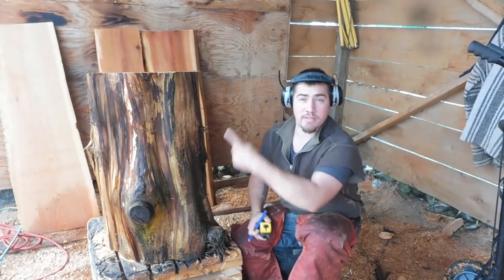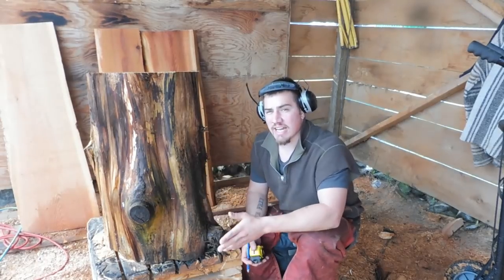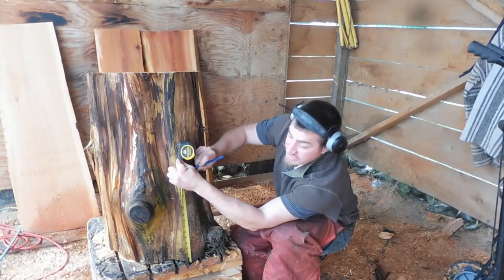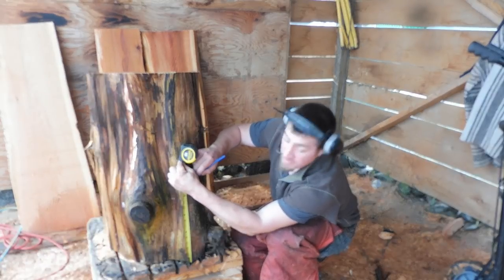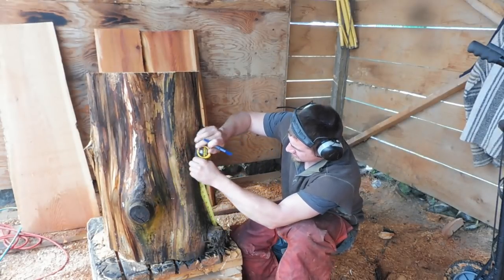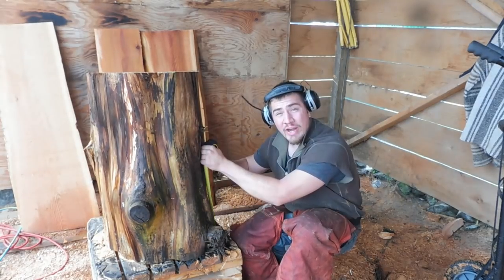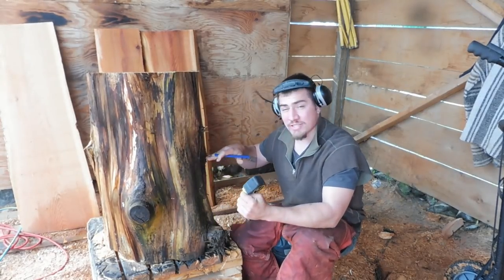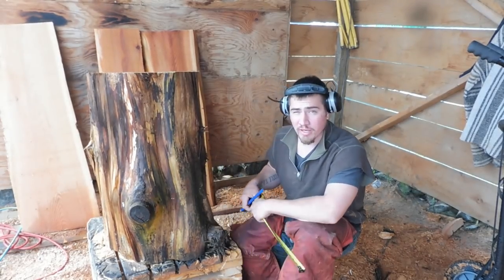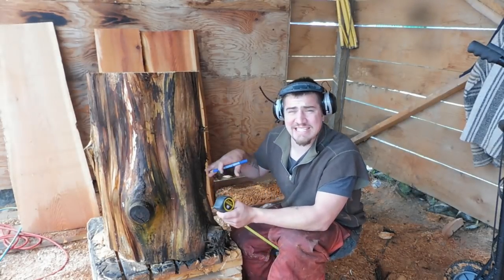In the back I've got two slabs that are two inches thick. Standard seat height is usually around 18 inches, so I'm gonna mark 16 on my bench — or maybe 15, we'll go with 15 — and I'm gonna do that in a couple of areas all the way around. About a foot in, I'm gonna grab my saw and cut that in about a foot. This isn't an exact science, it's log work, so don't try to be too perfect — just guesstimate about a foot.